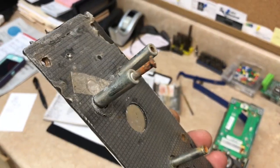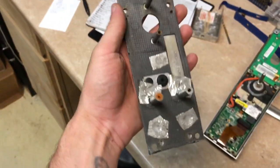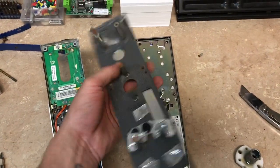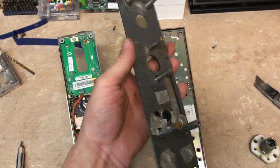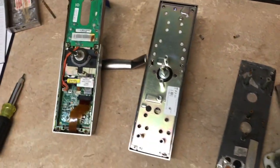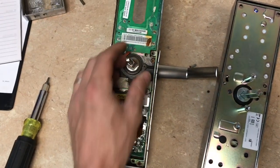Also keep this same back plate as well. Take that handiwork out — the screw I couldn't get out — bust that out of there, clean up these screw holes, and put this back on the new lock like so. Then the lock will just pop right in there. This is important when you're switching these locks out: they could all be mounted differently. You don't want to have to drill new holes into the door, especially if it's a push bar on the back — you want to keep that existing setup. I'm gonna take the back off of this one and put all the new stuff back together.